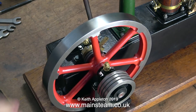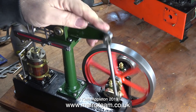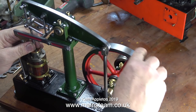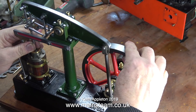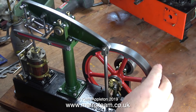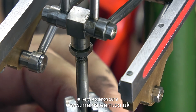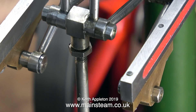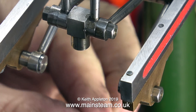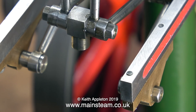When I turn over the flywheel it seems to be running quite free, but I can feel one or two tight spots. Most of these tight spots are nothing to do with the flywheel or the connecting rod — they feel to be more to do with the Watt's parallel motion. I'll leave it for now but it does need some attention. Quite apart from the rounded lock nut — and no, I haven't done that — I do not like how much thread sticks out. And after one and a half more turns of the piston rod, it fell out of the fitting.